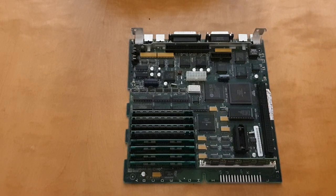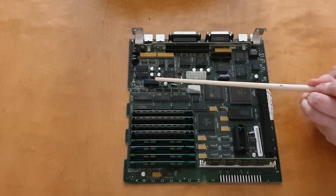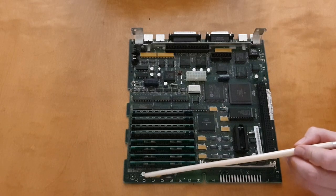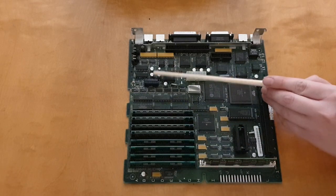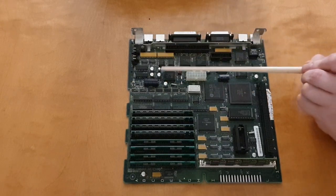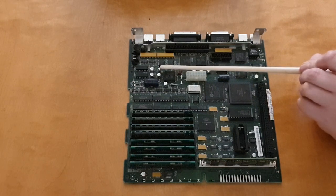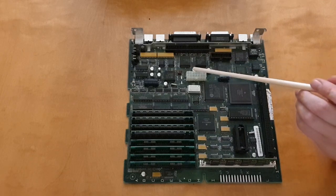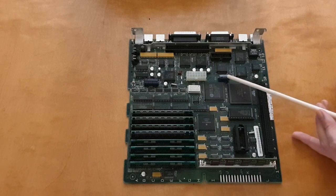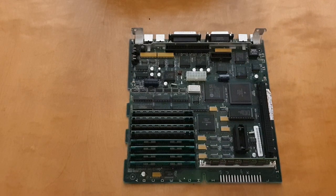The capacitors that I need to replace are this one, an axial through-hole mounted one, and these surface mounted electrolytic ones here. Four of them here, they are all 47 microfarad. One tiny little aluminum electrolytic here, that is 1 microfarad. 47s here, one here, and yet another through-hole mounted axial capacitor here. So that's all that I need to replace.